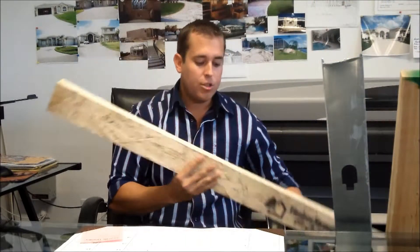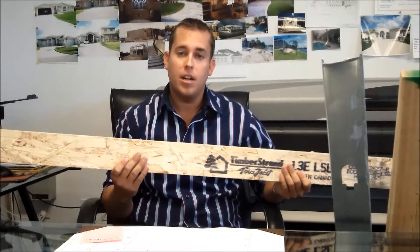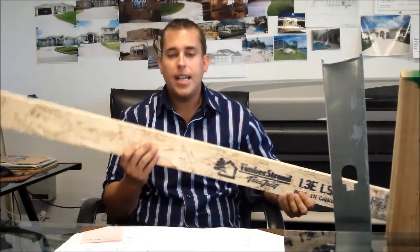Now I'd like to talk to you about timber strand studs. Here at Frank Frederick's Custom Homes, on walls that we build that are over 10 feet, and on all kitchen walls where cabinets are going to sit against at 10 feet in height or higher, we use what's called timber strand studs — which is this right here. It's composed of several pieces of wood pressed together with a resin. This stud is exponentially stronger and straighter than a traditional stud. It's far more expensive, but it gives you a much straighter wall and a much better product, essential for extra high walls or walls with cabinets that need to support the weight perfectly.